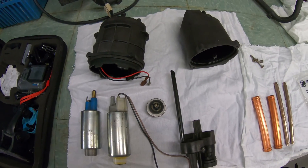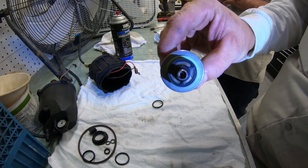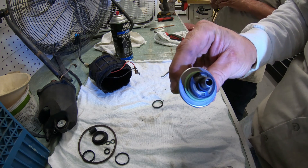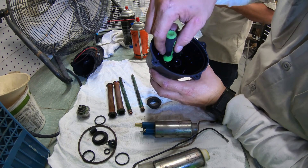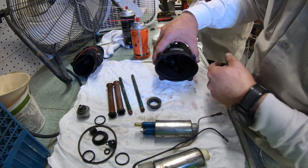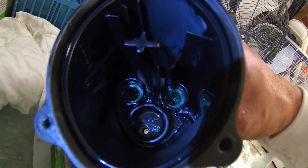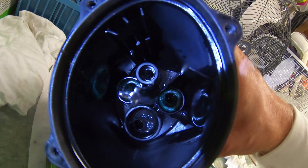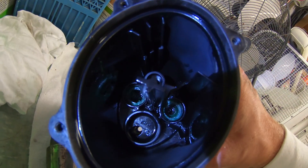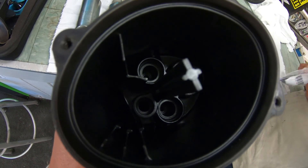You should actually just count on needing the seal kit to put these back together. Before beginning to put it back together, it is extremely crucial that we clean every single surface in all three of the plastic housings. There can't be any green buildup on any of the surfaces where those o-rings on the tubes sit, or else it will just leak and we'll be taking the thing back apart and redoing the whole thing. Once you have them looking nice and clean, it's time to reassemble.